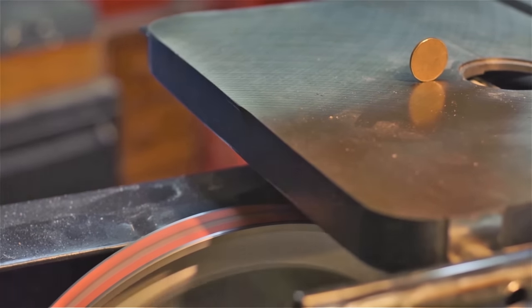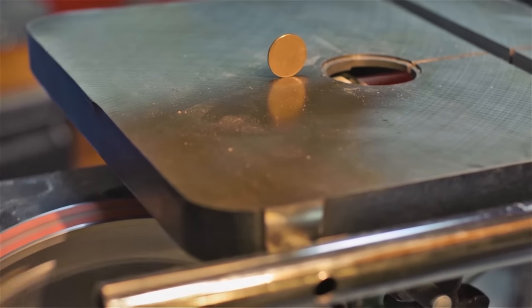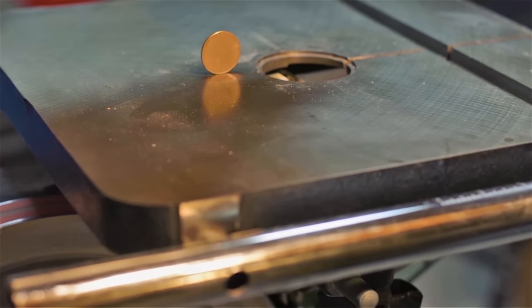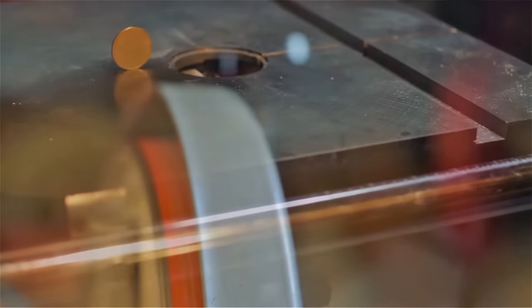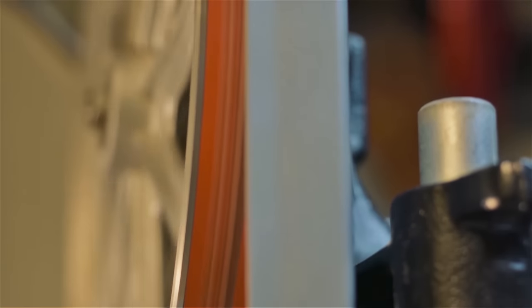Vibration does make a difference, so do your best to isolate any vibration in the drivetrain, especially in the lower wheel. The upper wheel, because it does the steering and the tracking, really needs to be balanced and wobble-free, so check it carefully and adjust accordingly.